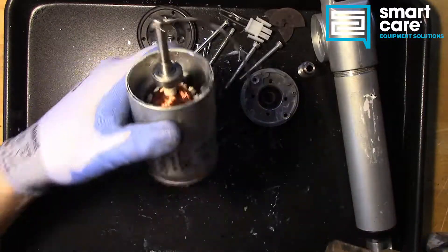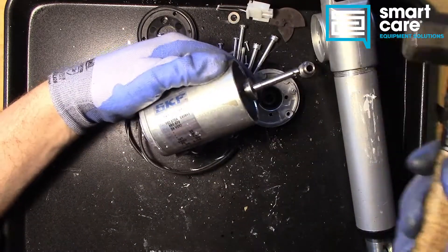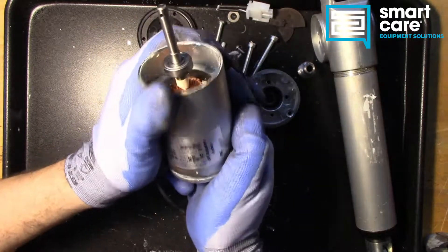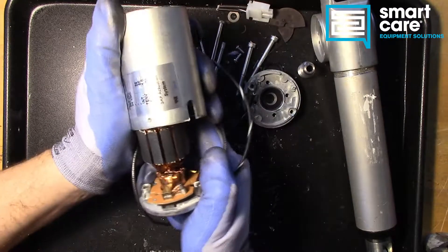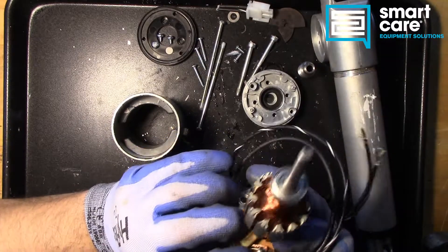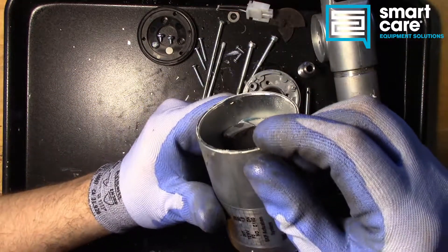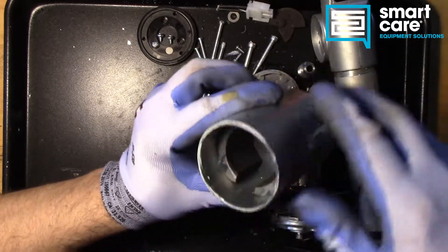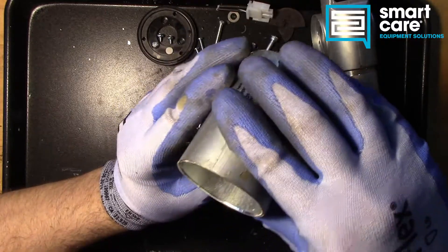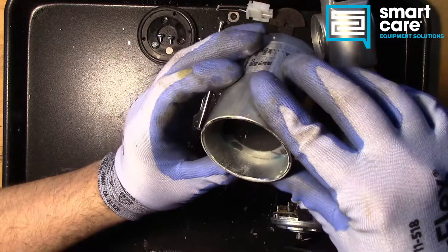Let's see if we can get the other end cap to pop off. Looks like it's actually been punched back at the back, so it's probably going to be tight getting it out. Now it's the force of the magnets that's really holding us together. We've overcome the magnets — so now we've got our stator out and our brush assembly is right here on the back of the motor. These are permanent magnets — rare earth magnets. When we talk about failures, one of the ways these can fail is if these magnets get cracked. If anything were to happen to the outside casing, like shipping damage or an impact that distorted it, these magnets would crack and we would lose the magnetic field we need to make the motor operate.